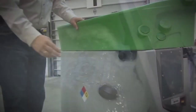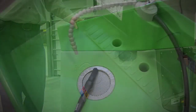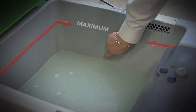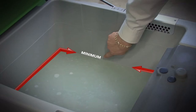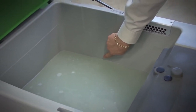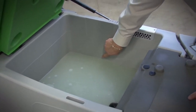When using the machine, if you activate the pump with the black mushroom button and nothing happens, it's something very simple. Please lift up the lid and check the level of the liquid. This is the maximum level, and this is the minimum level. It is recommended to operate the BioCircle machine between 80 and 100 percent of the maximum liquid level for optimum performance. We recommend that you check your liquid levels monthly.